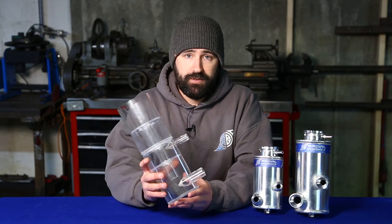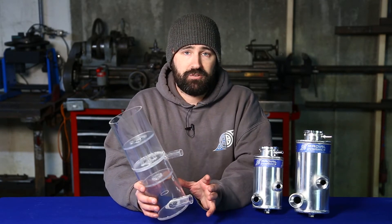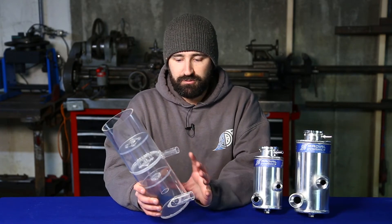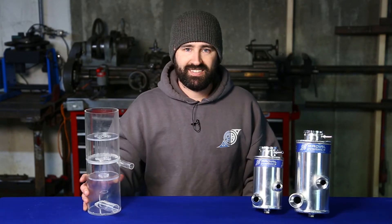What I'm going to do now is fill this clear reservoir with water, hook it up to a centrifugal pump, and when I open up my control valve I'm going to be forcing the pump to cavitate and producing a really worst case scenario operating condition. So we're going to see exactly how this responds. Let's get started.